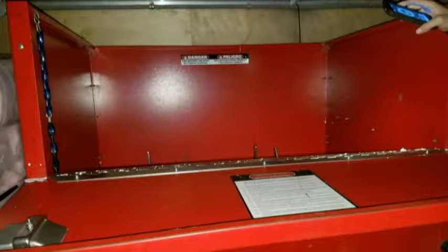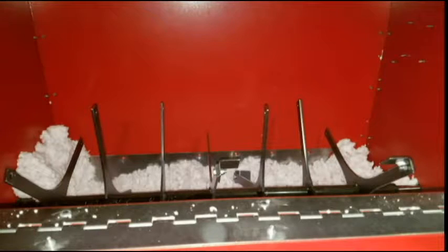Blow-in has 2 steps to it. You're either going to be what's known as a feeder or the hose operator. The feeder is going to remain in the trailer and feed bags of insulation into the hopper. This is a picture of the hopper. It's very dangerous, so be careful when operating it. If you get caught in it, it's probably going to kill you. In order to avoid getting caught in it, place insulation bags on top of the chamber like so, cut them open, and then close the chamber and let it feed itself. Be sure not to fill it up too much or you may clog the machine.